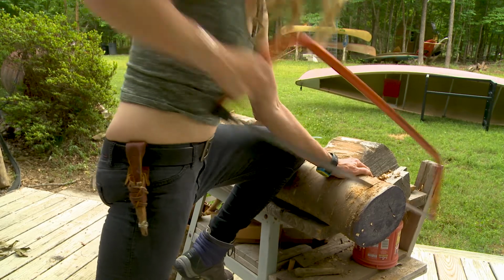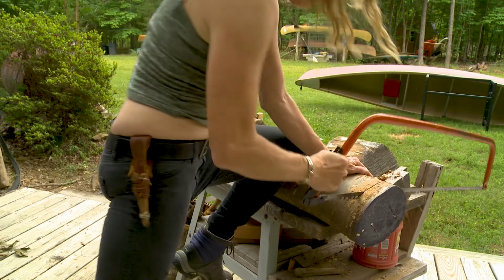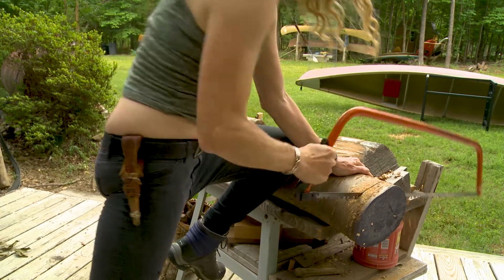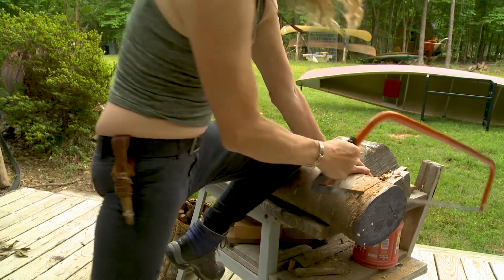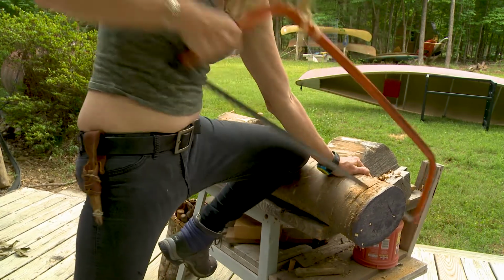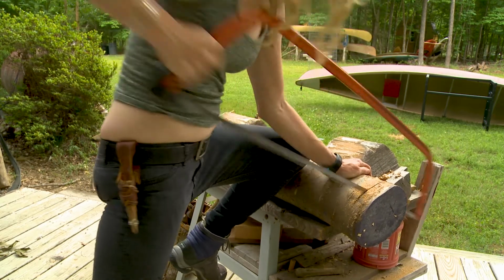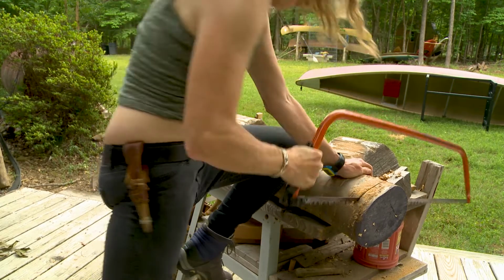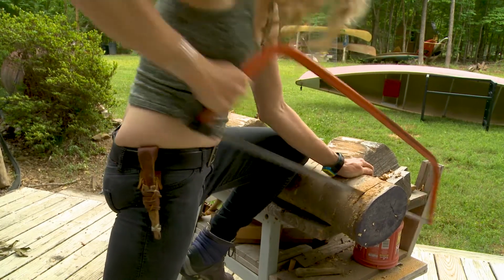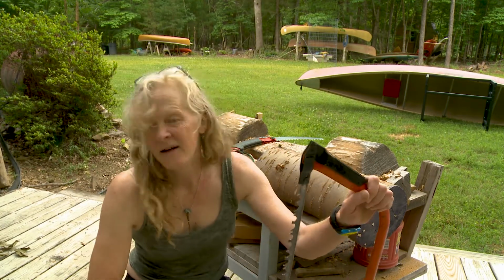And this is a push. You can see the difference. You kind of get a little oomph into it and you kind of push at the heel instead of pulling at the toe. Although you do a little of both. Very important to remember when using the Jap saws that you pull. You never push. This kind of can go both ways. Try and get your core into it. You get tired, take a break. Notice a wobble. Thanks for looking.